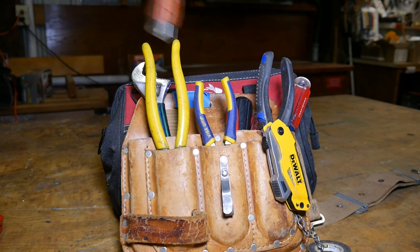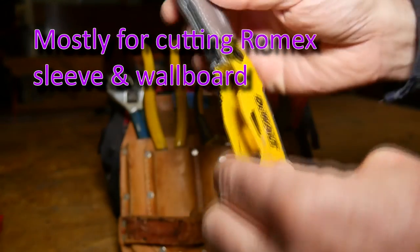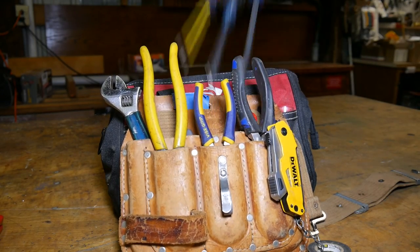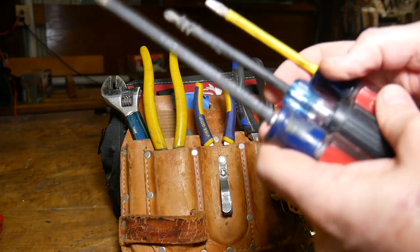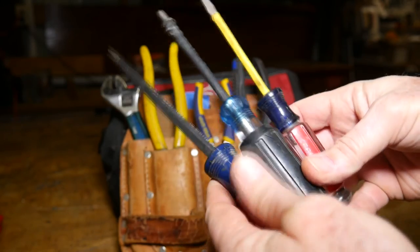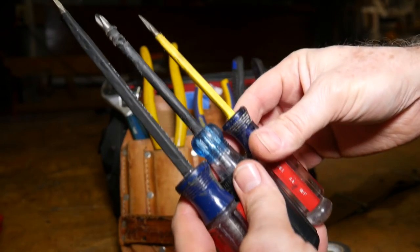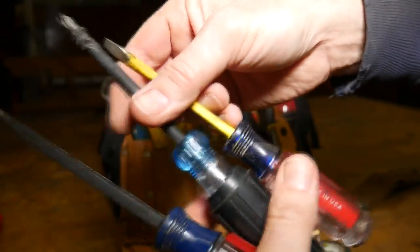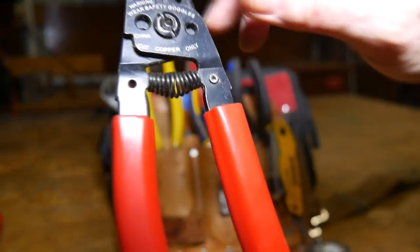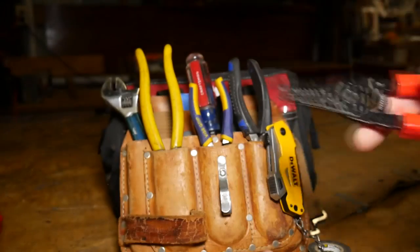Normal things: a crescent wrench, an extra cutter. I like these Dewalt box cutters — they're pretty nice. An assortment of screwdrivers, of course — Phillips and a couple sizes of common. I suggest you buy insulated electrical ones; they're insulated and have rubber handles. This type of rubber handle is better than plastic handles. I've also insulated some with shrink tubing, which is better than nothing. And a good wire stripper — this one has gauges from 10 up to 20 gauge, plus nut and bolt cutters.